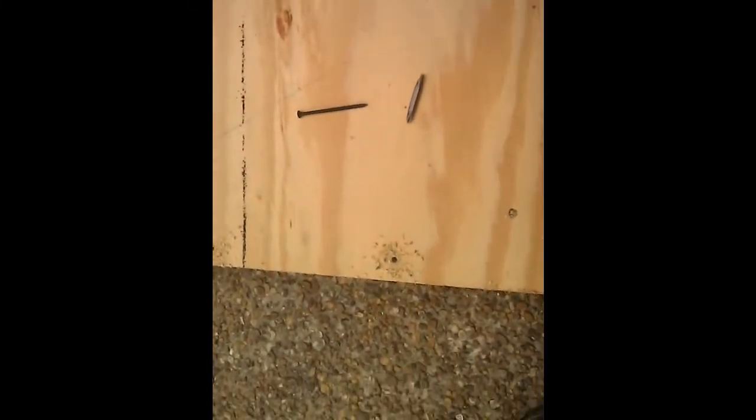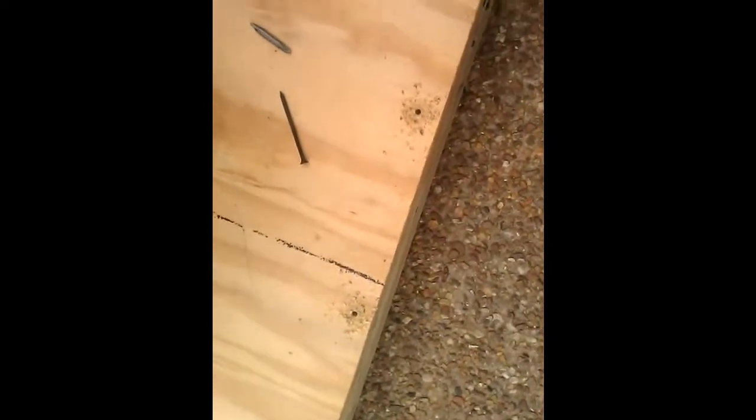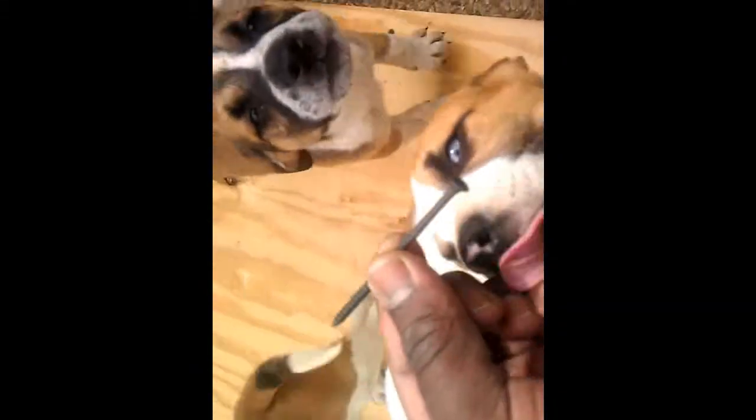I was really working and decided to stop and make a short video showing what I've done so far. That's the bottom piece on top of the treated wood underneath it. I went down the sides about every 10 to 12 inches and drilled holes to bolt the floor down. The puppies are helping me again. After this, the floor will be bolted down. The online design had the plywood sides going all the way to the ground, but my thinking is I don't want the plywood anywhere near the ground, so I'm going to bolt mine up higher — a little different approach.